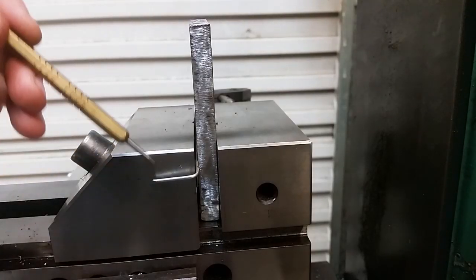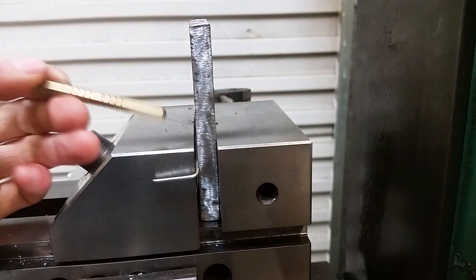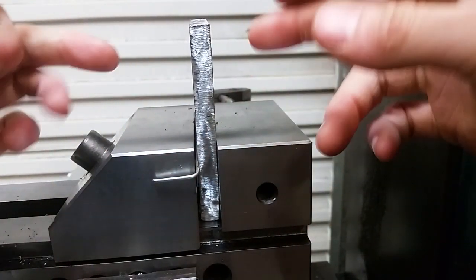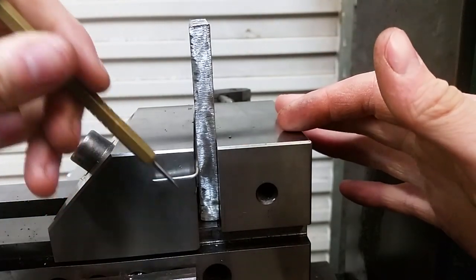In this setup I've got a piece of compliant aluminium wire in here. The reason for that is this plate is not machined and not flat, so without the wire the plate can hang up on high points, potentially creating a hinge somewhere on the plate.